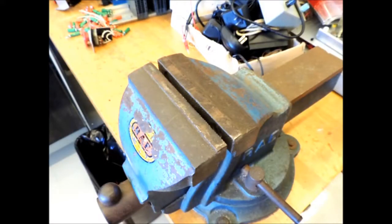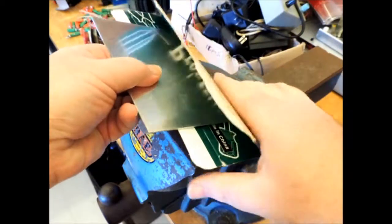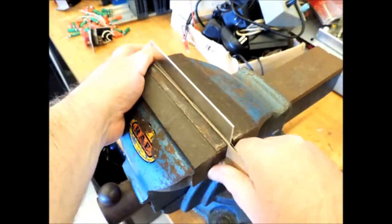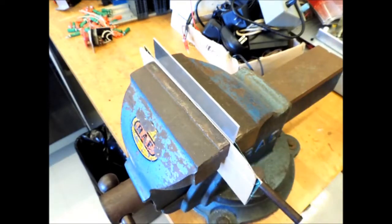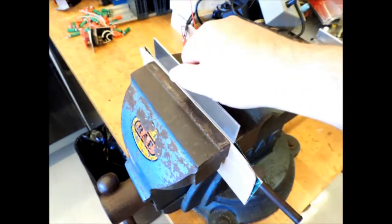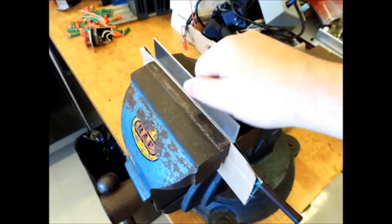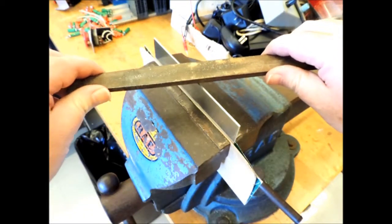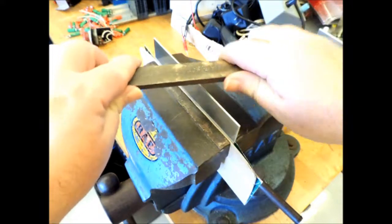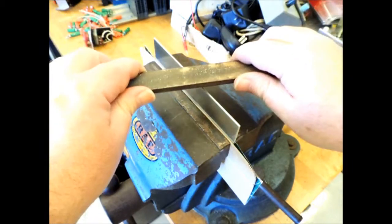The aluminum is also a little tougher on our belts, and you'll end up ripping them. So for those two very good reasons, we're just going to use the file. I'm going to take a piece of cardboard, put it around my piece of aluminum, and slide it a fair distance down into the vise and tighten up to hold it in place. You want it held fairly rigidly — you don't want the aluminum sitting way up high because then it'll wobble back and forth.